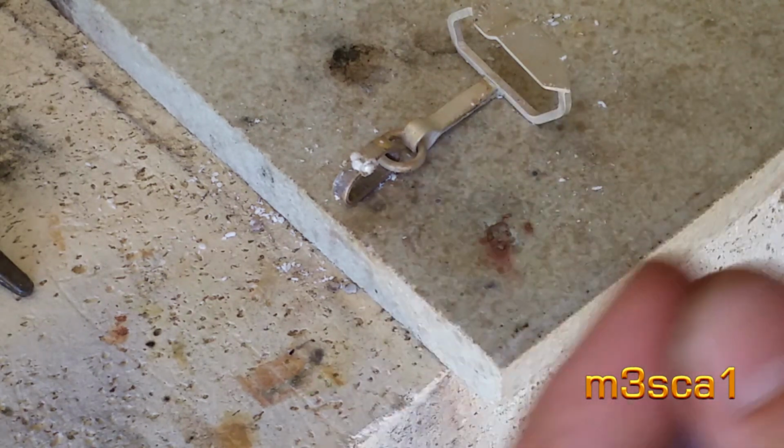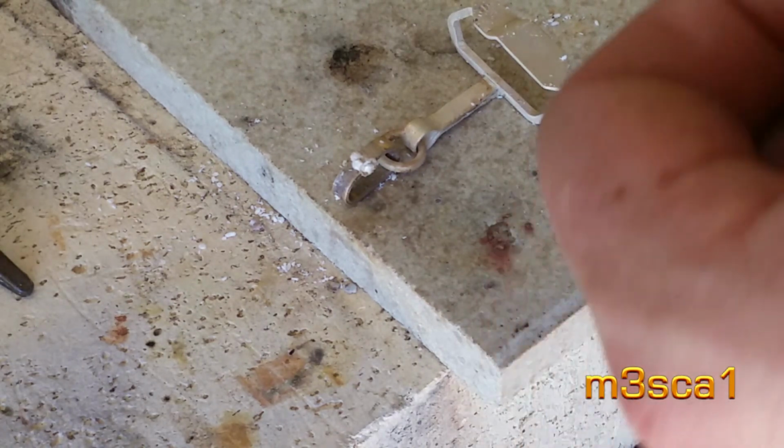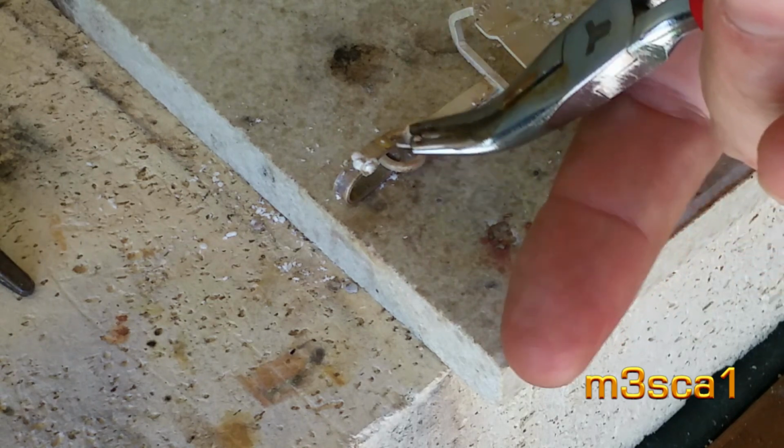A lot of guys have a perforated surface that'll take that heat down and away from the job, and that's ideal because there's been times I've had the heat of the tile reflect back and melt the job from below, and yeah, it was kind of an unexpected failure.